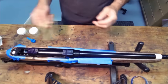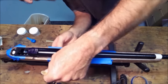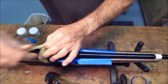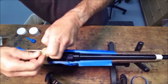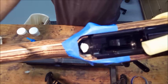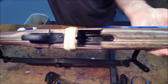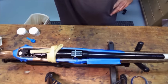It comes with some surgical tubing, and if you don't want to put the bolts in, just wrap this in here and it will be just like putting your bolts in. It's going to hold that stock rock solid. Pull it around, wrap it underneath itself — there you've got constant pressure pulling it down. That bedding material is oozing around all four corners — fully, fully supported. It's coming down through the hole, but we're going to clean that out with a drill bit when the time comes. We're going to let this set for a day or two, then we'll take it out and shoot it. That's all there is to it folks — that's glass bedding. Simplest thing you can possibly do to improve a rifle's accuracy.